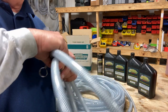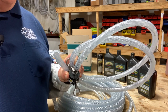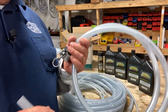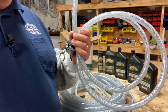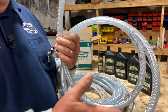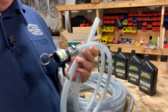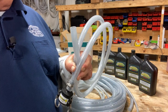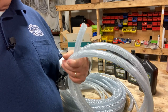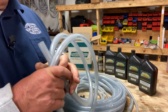If you want a hose like this for that third valve — if you're going to do like me and not run your soap to a soap tank — then all you need to do is buy the proper size hose. Having extra hose left over is always a plus. You'll just need an extra banjo fitting, put it into your hose, clamp it, and that gives you the ability to stick this into a bucket or a separate tank to draw your solution out using that third valve. Make sure you order yourself an extra banjo fitting off the website if you want to do something like that.